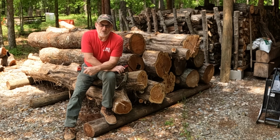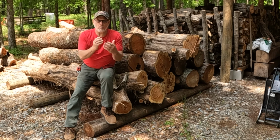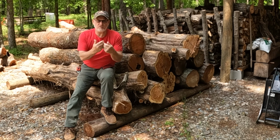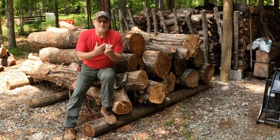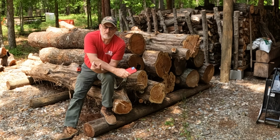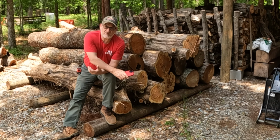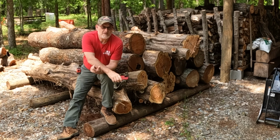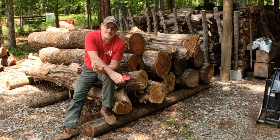And being a cedar log, cedar tends to grow outward and then it'll grow around itself, so you'll have some bark inclusions in there. Sometimes it looks okay, sometimes it doesn't, but it makes it hard sometimes to find a good piece of wood. Typically you can't just cut them out of the middle with the pith, because usually on a cedar tree your pith is going to be rotten.